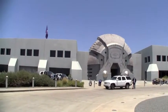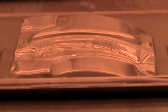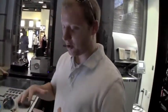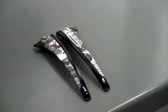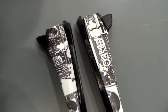What do you have here? What we're doing here is a vacuum form sublimation. We're putting film into direct contact with our parts and heating up to about 300 degrees Fahrenheit and sublimating that part. So it's going from a solid to a gas back into a solid inside the part. We're opening up the pores of the part by preheating it, so the plastic pores kind of open up. Then we print onto the film with a dye dispersed ink. It heats up, goes from a solid to a gas, then goes into the pores of the part and we close those pores back up. We end up with a really protected coating that's scratch proof, UV proof, and we can customize the surface — so you can do any graphics on it that you want.